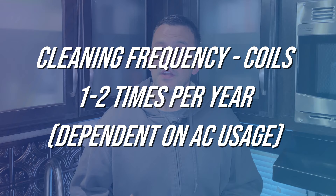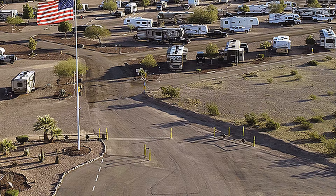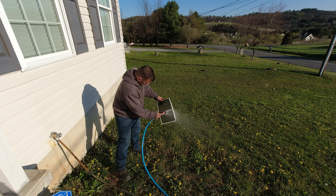Let's talk about frequency. You should be cleaning your air conditioning coils at least once and probably twice a year. That number does depend on the environment you camp in — if you camp in the desert or a lot of dusty areas, you might want to ramp that up to three or four times per year. For your interior air conditioner filter, you should be cleaning it once for every season that you camp. For us, that takes place at the beginning of summer and at the beginning of fall, and we'll usually do that when we winterize the camper.